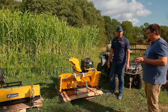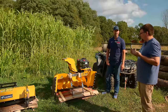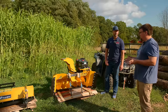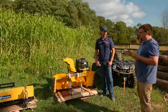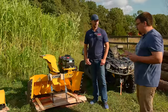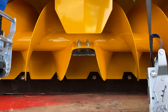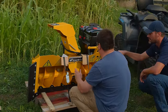This is strictly a single-stage snowblower for good reasons. Being a front mount, you want it as tight to the front of the ATV as possible so you can pivot it up and lift it out of the way. Two-stage competitive models end up being much deeper with engines further back and chains running to the rear of the ATV. These use a standard snowplow mount bracket — two pins, hook up the winch, and you're ready to go. They use their MDS system — a rubber flap that acts as a squeegee to push snow up through the chute, and also as a bypass so there are no shear pins.